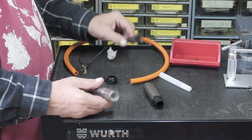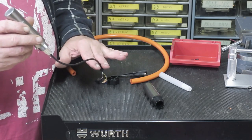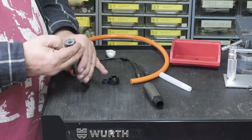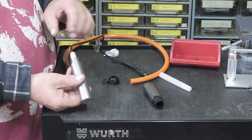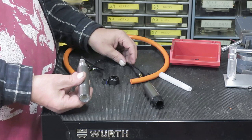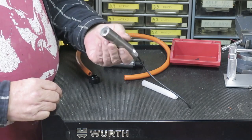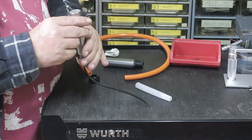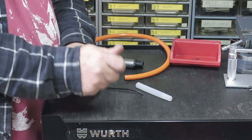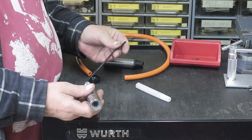It should be quite near the surface of the lens. Okay. Next thing is for me to test this before I cut this, so I can see whether the lens has the correct distance. If not, I have to shorten this one a little bit. So I will test it now. After testing it, it's actually perfect. And because this is glass, you can now wipe it clean like that. That's very good.